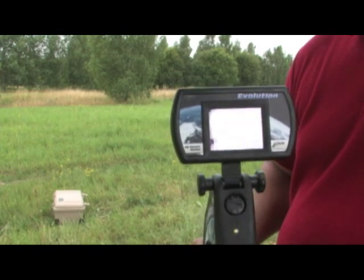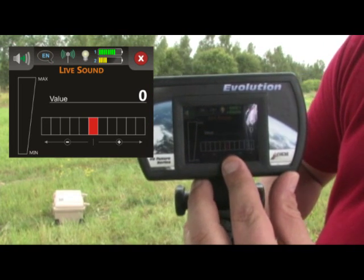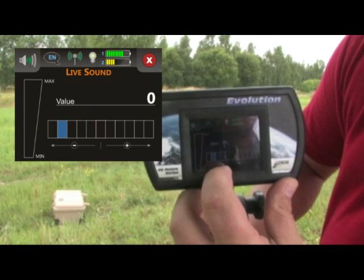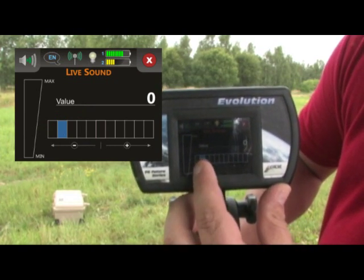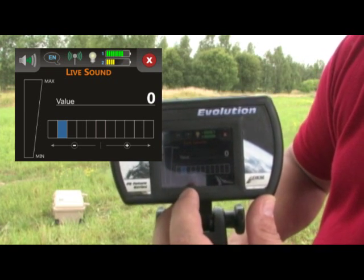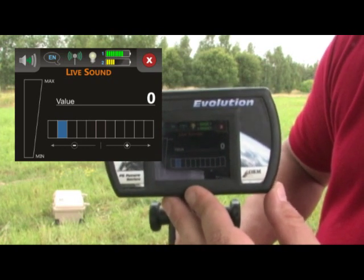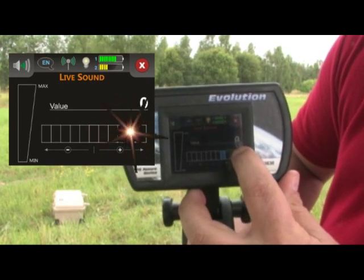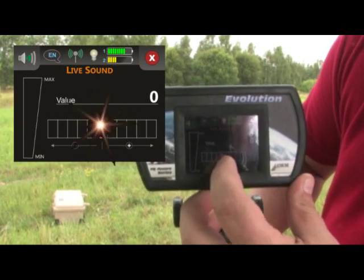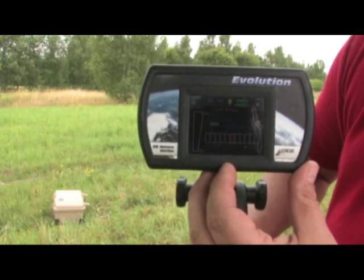In order to adjust the sensitivity of the live sound, you'll see here there's a meter. When it's on red and set directly in the middle, it's automatic. If you need less sensitivity, you push towards the left side of the middle and you'll see it'll change the sensitivity down so it's less sensitive. The reason you'll use less sensitivity is if you're in a highly mineralized soil where it reacts to everything. If you're in other soils which are very clear, you can increase the sensitivity to the other side to look for more smaller objects.